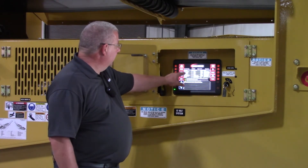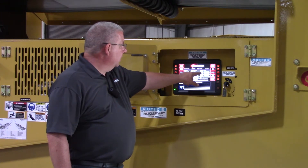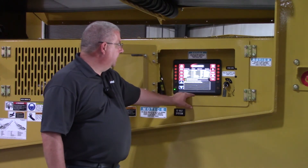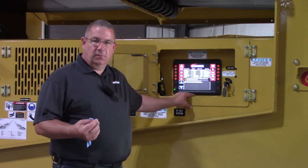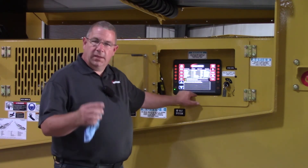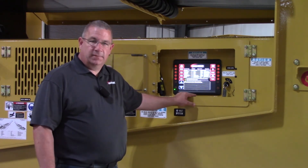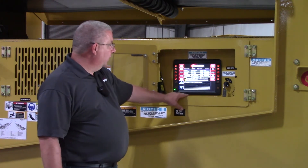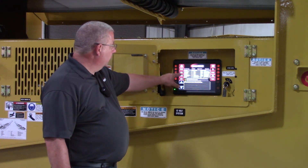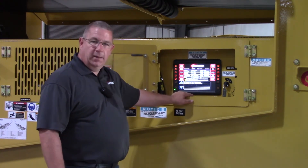The next one is going to be grease valve A. It's going to be one fitting every 40 hours. It's at 14 hours now and it wants you to have 18 pin cycles. This has a centralized grease system on it and you'll count the pin going in and out on that block as you pump grease into it 18 times and so on. If you grease that, you would go ahead and reset grease valve A and it would take it back to zero hours and it will also document it there.